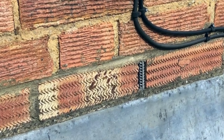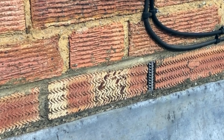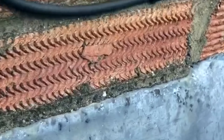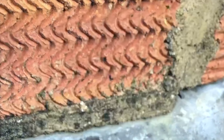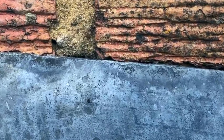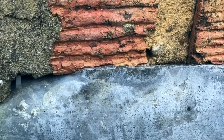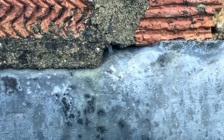We're being paid for a survey and we want to give the client the best advice. If I've got to be on site an extra half hour to find out what's going on, so be it. One good thing to do when looking at flashing issues, particularly on non-destructive surveys, is to see how far it's been chased in. You can see straight away it hasn't been sufficiently chased in.